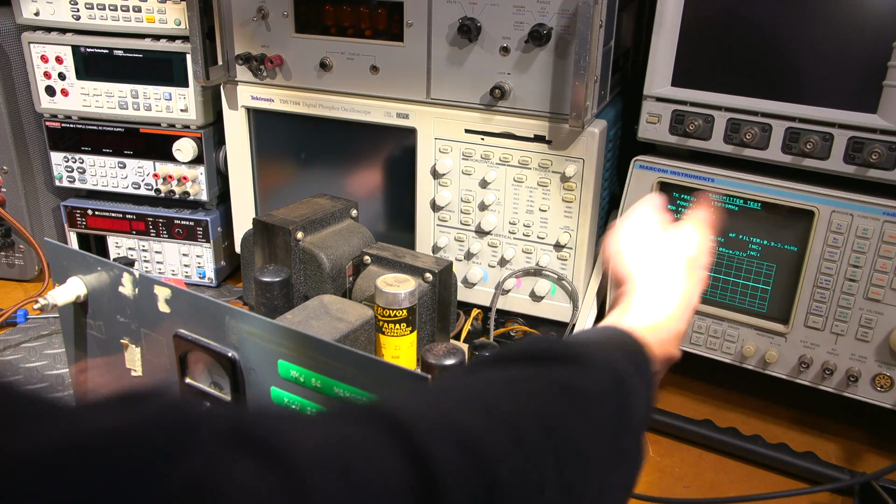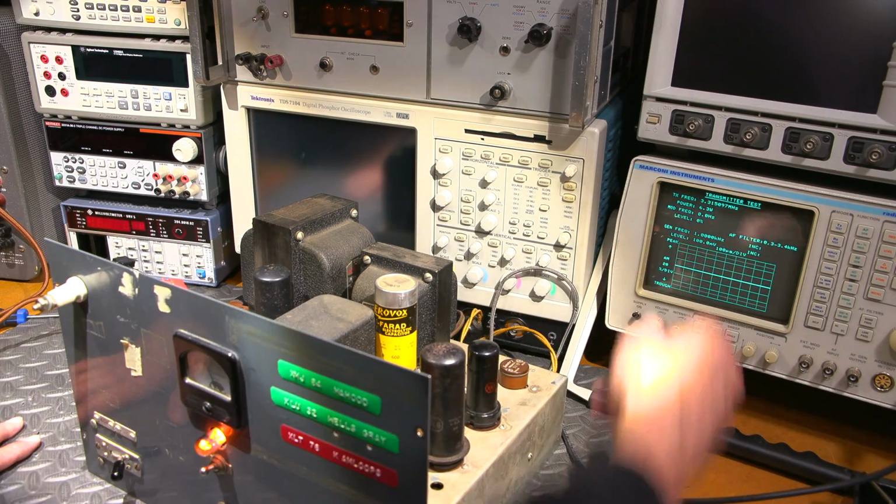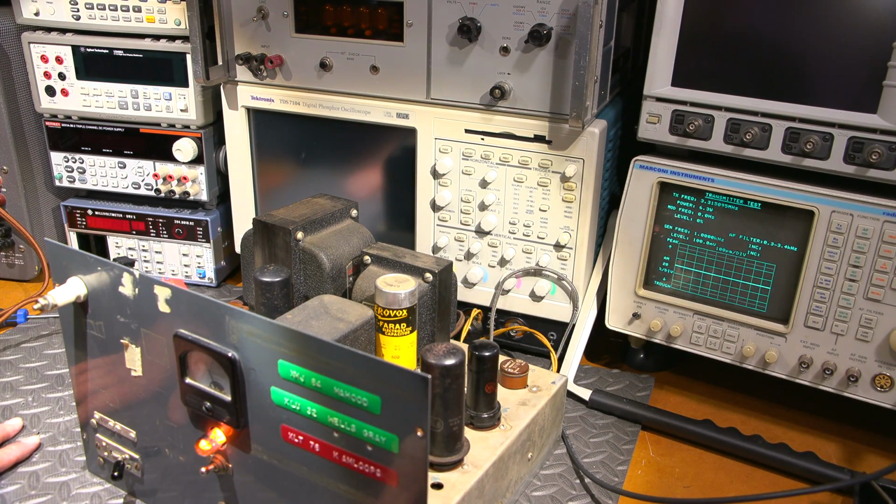As you move this around and as things heat up, the last three are going to move around just a bit. So what I'll do is bring this just out of the dip. Now, as I mentioned in the previous video, you usually get maximum power outside the dip just a bit. And as you can see, I can get this thing up to about 11.4 watts or something like that now that the rock is working correctly.